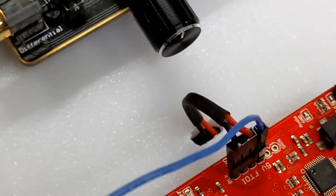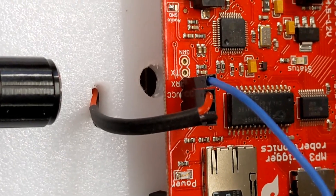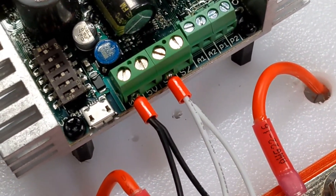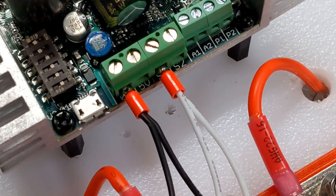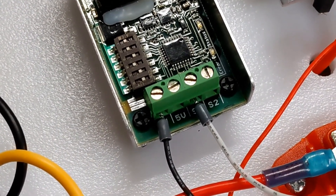That simply goes over to the MP3, where I'm using the 5-volt input on the FTDI socket, and I also have the input on the other side. On the Sabertooth side, you've got the signal wire coming into the S1 input, and that is daisy-chained — as is the ground — into the corresponding S1 and ground on the Syren.